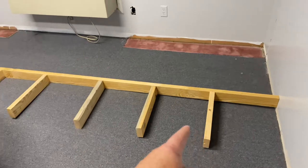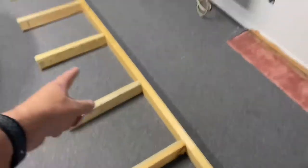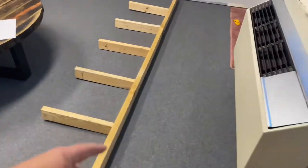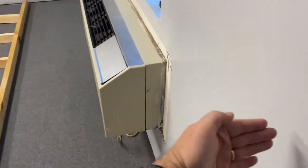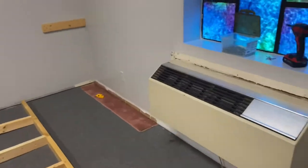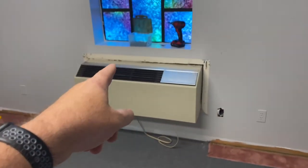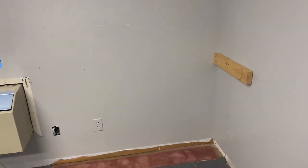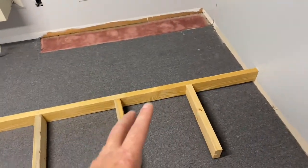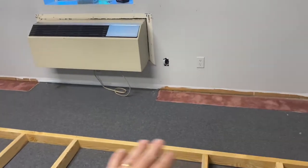Now that our paint's dry, we've assembled our frame for our countertop. We didn't put the front on yet, but we've spaced these about 18 inches apart. We're putting screws in from behind so this goes into the wall. We are using half-inch plywood for our countertop, so we're dropping a half inch below that windowsill all the way across — about 36 inches on the windowsill, so we're at about 35 and a half over here. We're going to tie that into the wall studs, then put on our front and begin to assemble the bottom.